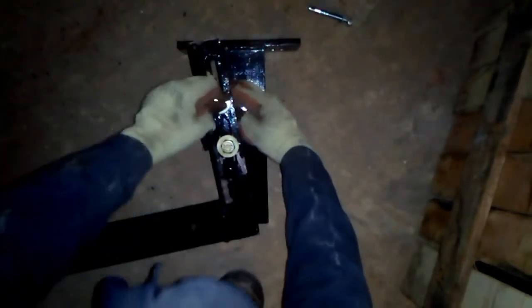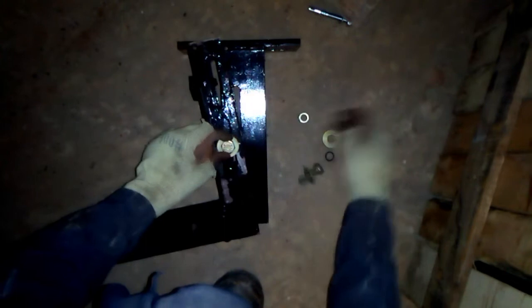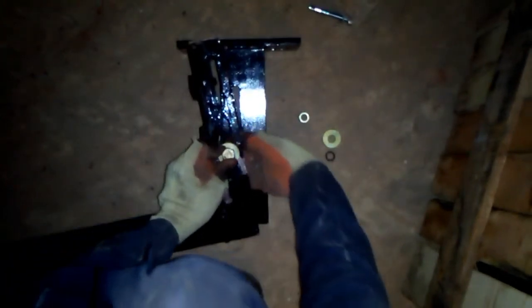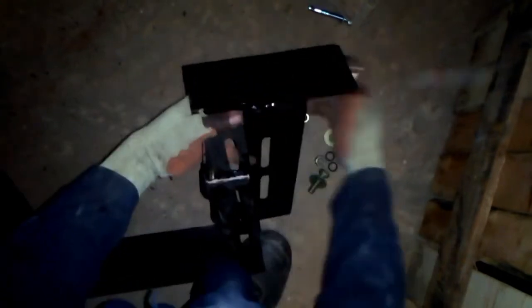Let me tighten this one first. I open the nuts — just like that, put those on the side, and also these other ones. If they are hard just use a spanner. Now this one you pass through this hole — there is a hole here — then you pass it through here. Then put back the washer, then spring washer, then the nut. This is a lock nut, it locks from both sides.